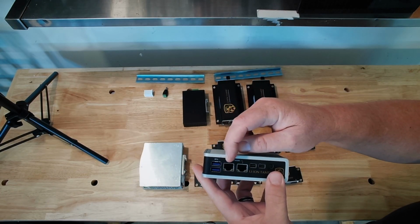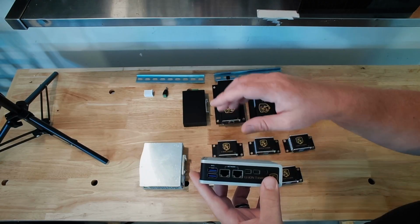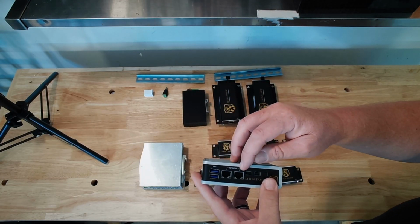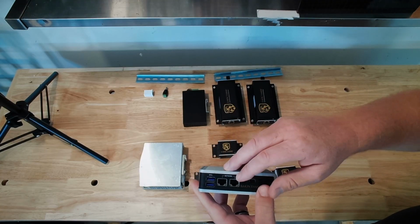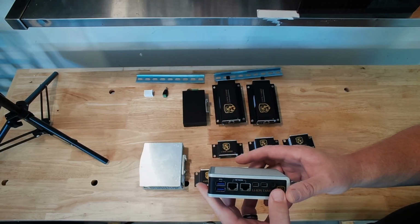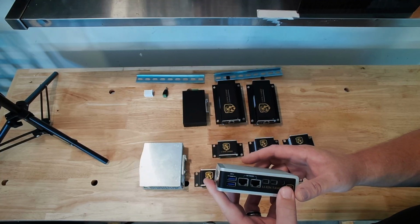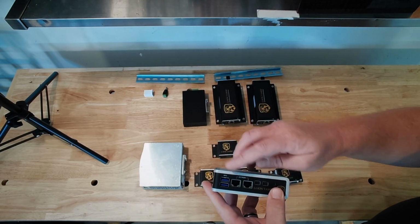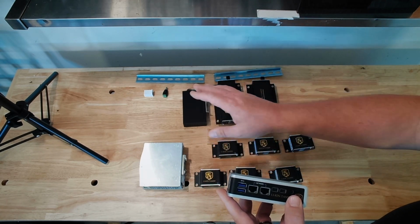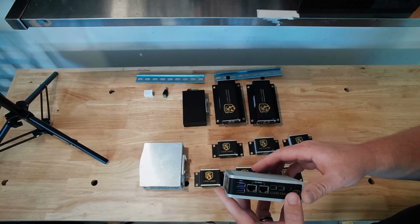Network port number 1 is the network for the Lion Tamer itself. Network port number 2 is to transmit out to a controller using TCP/IP Modbus. So network port number 2 is going to go to our switch and on and into the rest of our system, along with our programming computer that goes to it.